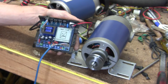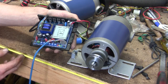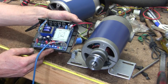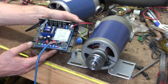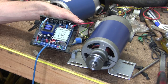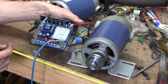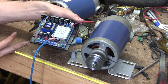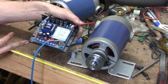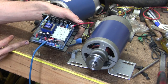This is the speed control that I'm going to be using. It's not a bad little speed control — supposedly rated at 10 amps. It's got acceleration, deceleration, max speed, minimum speed, torque which is basically the maximum output current, and compensation which is RPM. It feeds in more current as the motor slows down and tries to keep it at a constant RPM. There's no RPM sensor on this one unfortunately, which would be good, but they're not easy to find that type, so we'll run with this one and see how she performs.